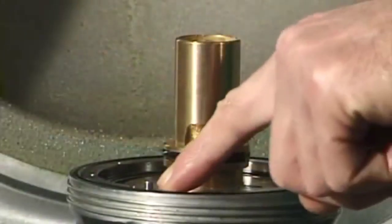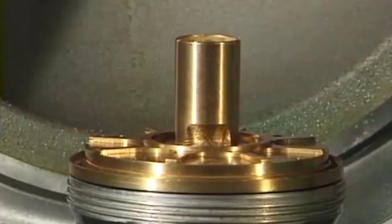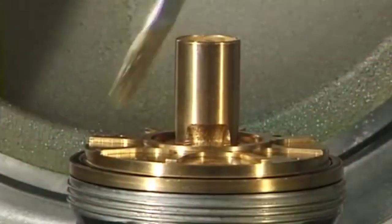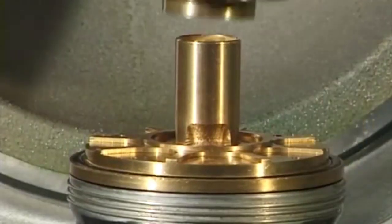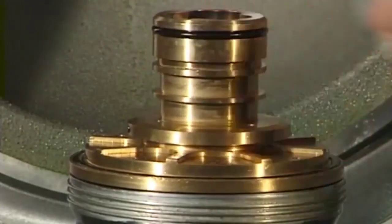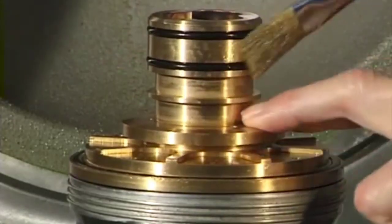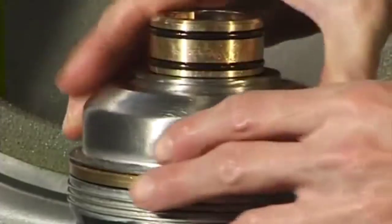Mount the centripetal pump chamber cover. Pay attention to correct positioning. Insert the gasket in the groove of the centripetal pump chamber cover. Install the sensing liquid pump. Insert the gaskets in the grooves in the sensing liquid pump. Grease the guide surfaces. Mount the centripetal pump chamber cover.